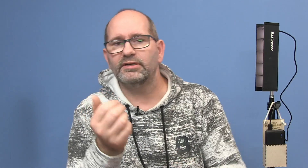You will need a 3D printing nozzle with a hole of 1 millimeter. You don't have to buy that nozzle — you can just take an old nozzle and create a hole in it by drilling it. That's the way I did it: I used an old nozzle I couldn't use anymore on my 3D printers and drilled a hole in it. If you print the air assist at 0.2mm layer height, the threads inside will be perfectly sized for that 6mm nozzle so you can turn it in just like a screw. The same goes for the other side where the tubing goes in — just insert the tubing and it will sit great.